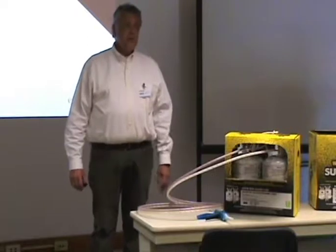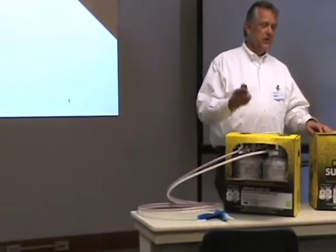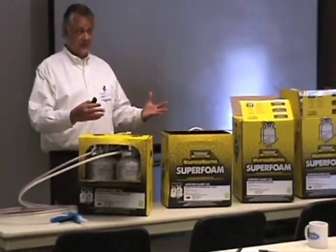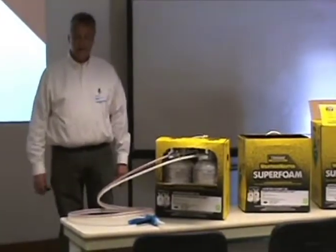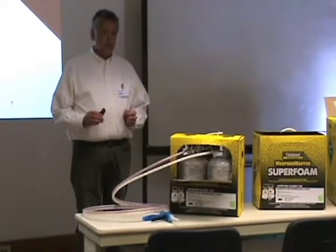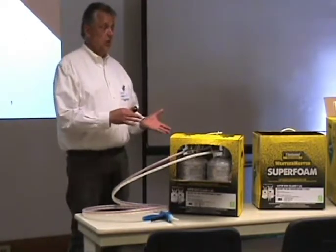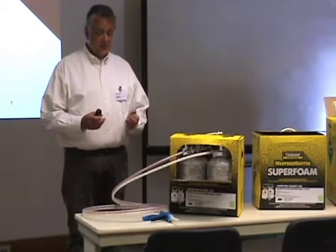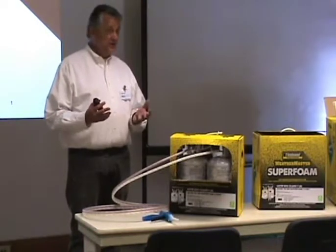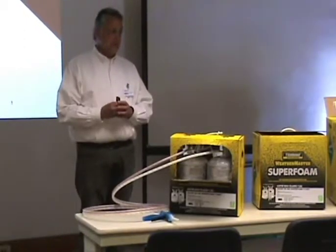Any issues with heat buildup? There can be. I don't recommend that. I've sprayed a lot of foam into things like that, just trying to get empty weights, and I've never had it happen. When you hear about flashover or flashpoint on foams, it's usually high pressure foams. This is low pressure. High pressure is different because you're spraying at 1500 to 2000 PSI, heated to 140 or 150 degrees before the chemical temperature, so the reaction temperature is a lot higher.